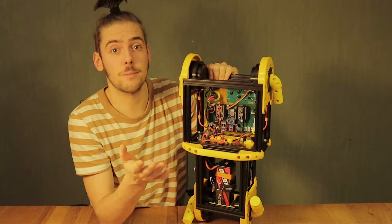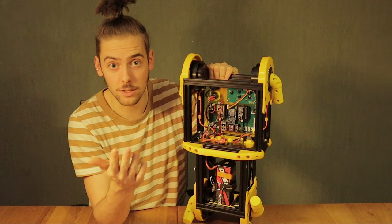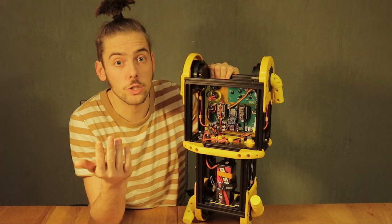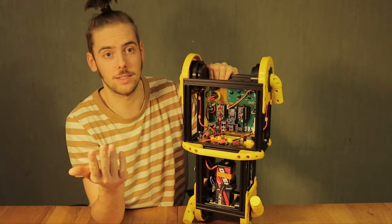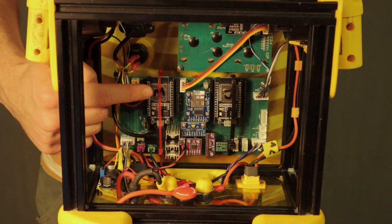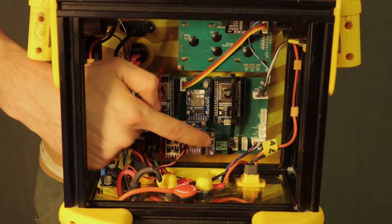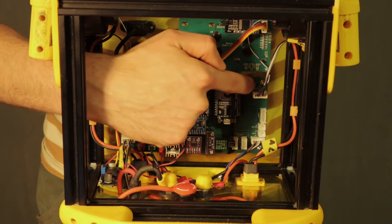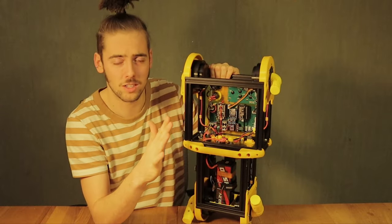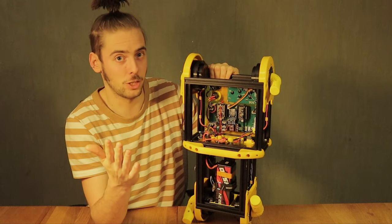The control boards of the motor use the CAN bus to communicate. It can receive targets like position, speed, or torque, and in return sends back actual position, current used, temperature, and those kinds of things. I had never used the CAN bus before and it was a bit tricky to set up — I'm using ESP32s to send data, but it needs to go through a logic level shifter, then to the CAN transceiver, and you also need terminator resistors, and the CAN network needs to be in a certain shape. But once you have it all set up it's actually super stable and I've never had any issues since.